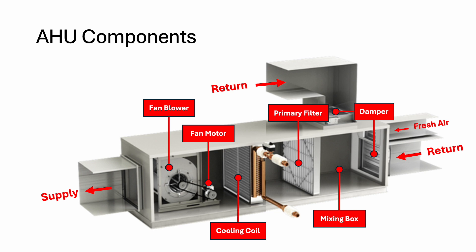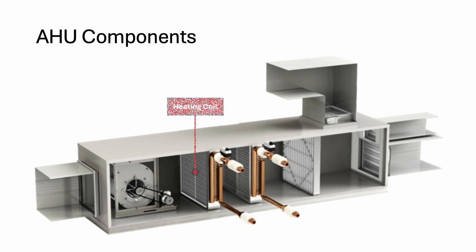So about customization — for example, if you are in somewhere that needs heating in winter, you have to add another coil, or if you need more dehumidification, you cool then reheat. So you can add a heating coil to the AHU. Another thing you can add is UVGI — UV lamp. Some people say it sterilizes the air, but most of the time it's about preventing mold from growing on the cooling coil.